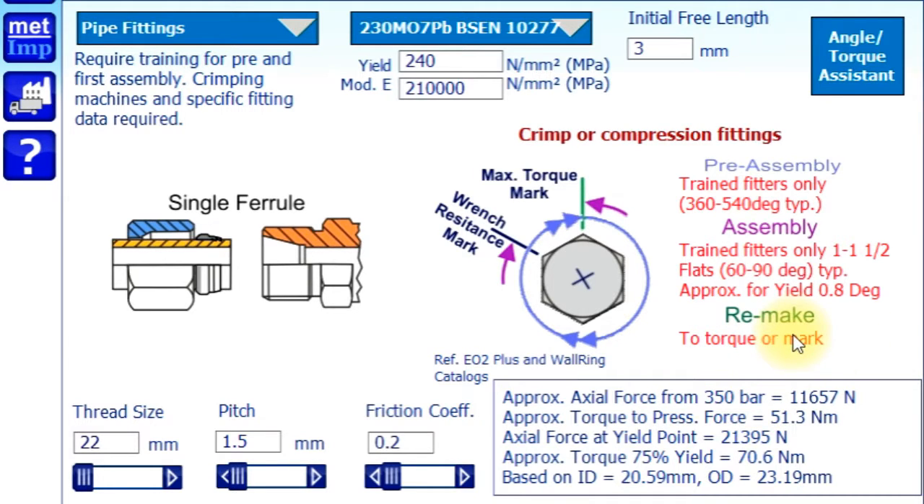So when you're taking it apart a couple of times, we always recommend you mark it, so we've got your procedures in here. You tighten it in and you mark it so we know where that point is. We know where those re-torque points are because it's unlikely you'll have the torque from the initial time that it was assembled.